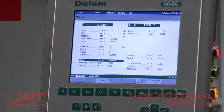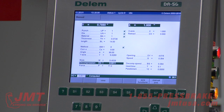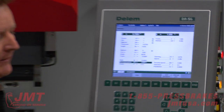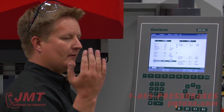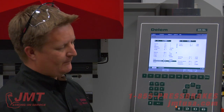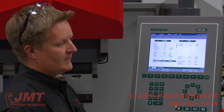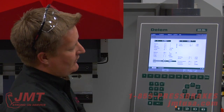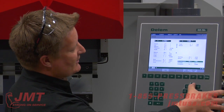A 90 degree mute is what it's going to fast approach to and then go into bending speed. Decompression is the opposite of bend. If I have a big panel or a big part where I need to bend it, I'll slowly bend it and then slowly let it back down — I can actually program a decompression. I picture it like a pair of vice grips: if you let all that tonnage off at once on a big panel, it's dangerous, and you'll also get much better parts if you can slowly decompress that tonnage off.